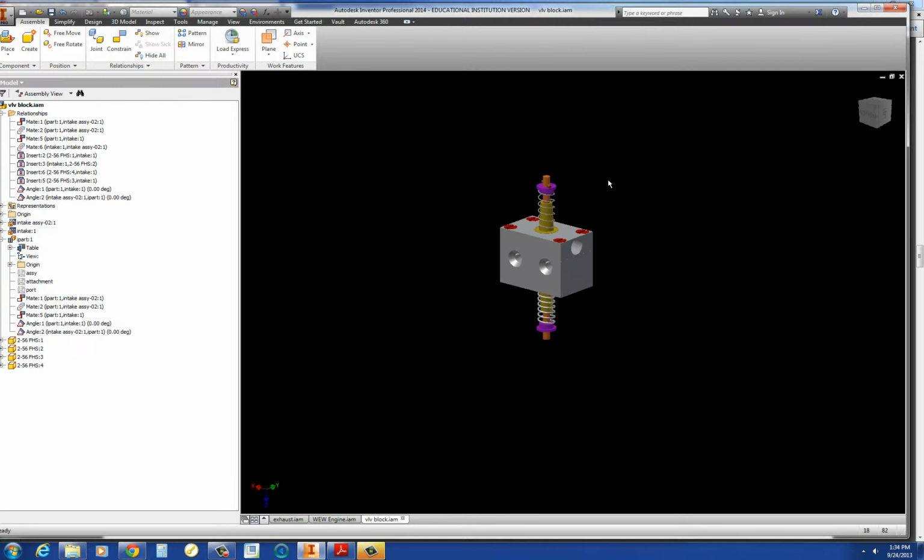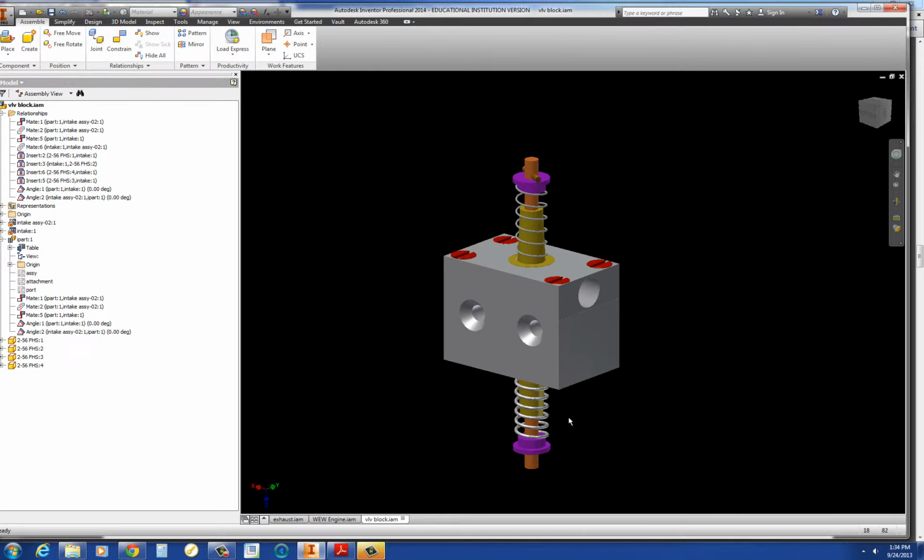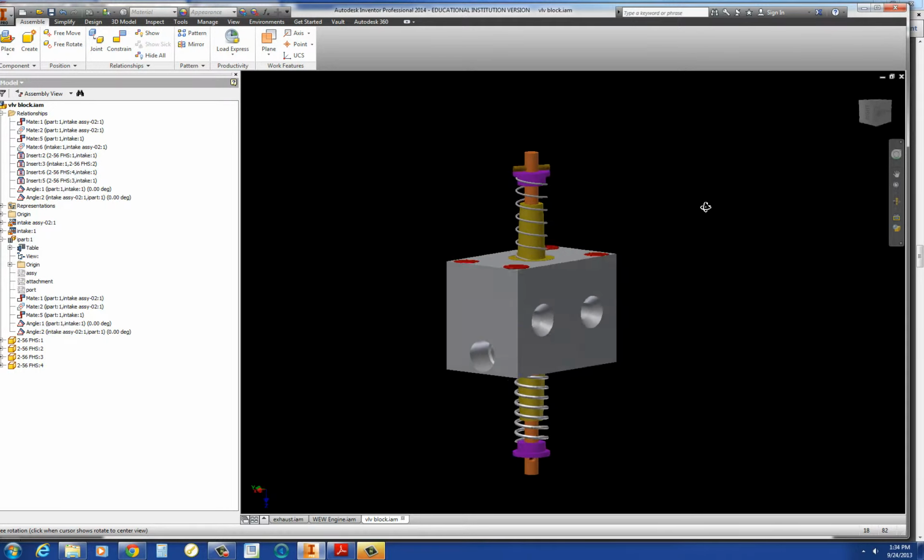From the valve block, what we have are springs on the top and bottom. So this is a subassembly. This valve guide would be press fit into this valve block, the intake, as well as the exhaust block down here. Then the springs would be put on, the keepers would be put on top, and then a pin put through here to secure the pressure against the spring so that the keeper stays on and the spring stays in.